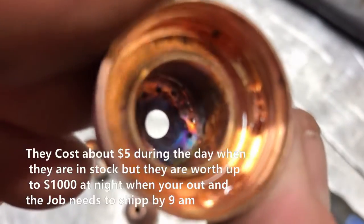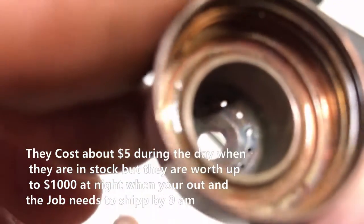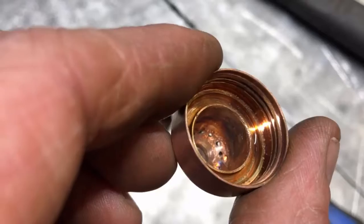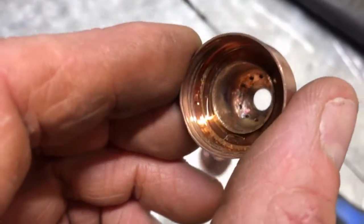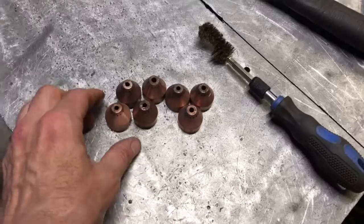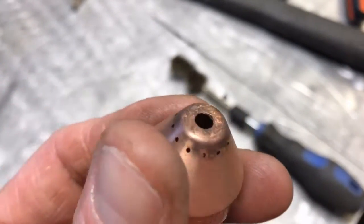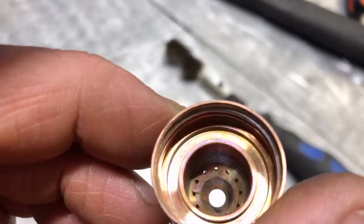You can see I've completely cleaned these things out. That discoloration is where the metal slag was — I tried to wire brush them a little bit to give you a better look. There is no buildup, just discoloration. Some of these I cleaned out with a carbide bit before the acid treatment, which is why they have scratches. All of that slag is gone — the acid dissolved it all out in about two hours. Every vent port is completely cleaned out. The cool thing is that often when a pierce height goes wrong, the only part destroyed is the shield that just gets clogged, not the actual tip.